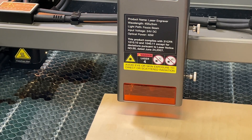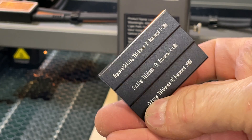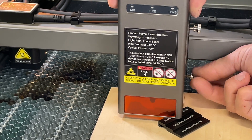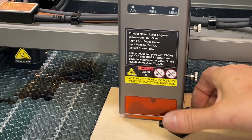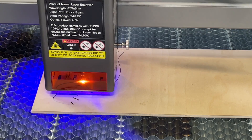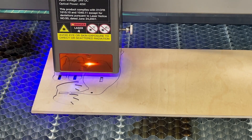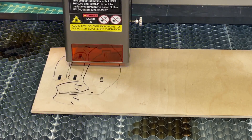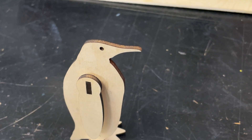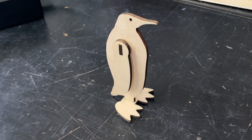I decided to do a little cut project, so I started with some eighth inch plywood and dropped it in under the laser. I need to focus the laser and I have to use this focus block, which I guarantee is going to get lost. It's a little old school but it actually works fairly quickly — you just loosen the two knobs, drop it down onto the block, and you're focused. I started my job — it's the little penguin model I created a while ago to test things. Not surprisingly, a 40 watt laser is an amazing cutter. It doesn't take a whole lot of the 40 watts to cut through eighth inch plywood, and when it's finished you can see it all fit together very nicely. The edges of the wood are very clean and the whole thing is really precise.